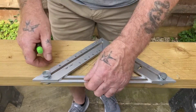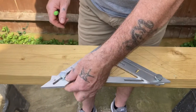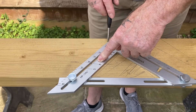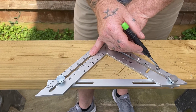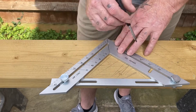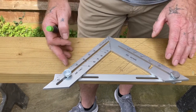The idea of it is that when we set to a certain pitch — so in this case 40 degrees — when you place the tool on the workpiece or the rafter, you know that when you do this 40 degree plumb cut, this will automatically be 50, because you've come in one notch. One notch here is 50. So you'll automatically know what your plumb cut and your seat cut degrees are.